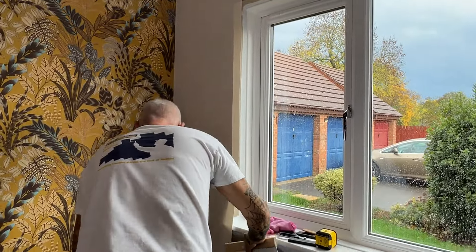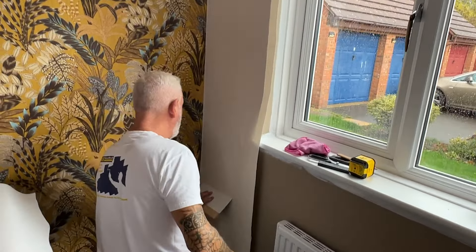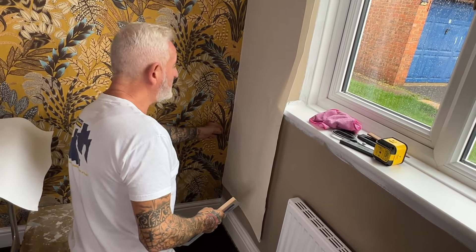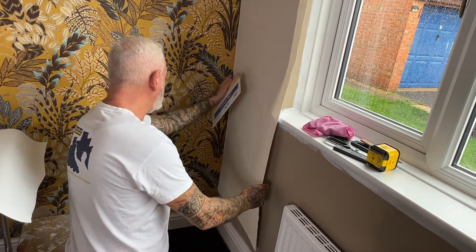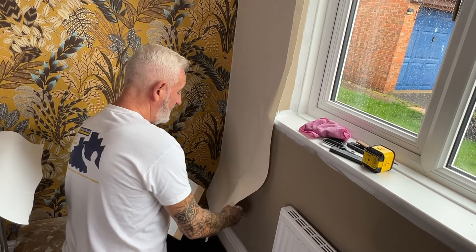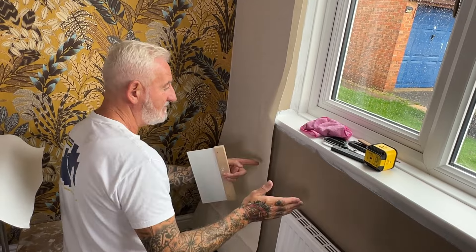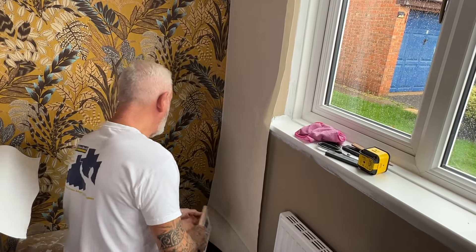I'm going to set the bottom of the paper to keep it running straight. If you find that paper is overlapping at the bottom, don't twist the paper — just let it run straight. You can cut this away if needed, but your paper needs to run vertically. Don't twist it, because you'll have to twist the next length to meet this and your paper won't be level.